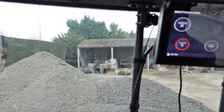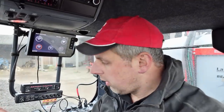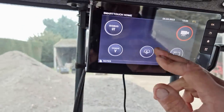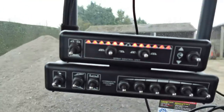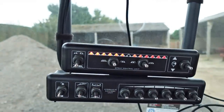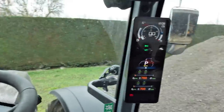You've got the option - they're both ISOBUS, they're both GPS. So you can run one screen as the ISOBUS to control the machine and the other one as your GPS, or as a camera. So that's the sprayer screen on the ISOBUS where you can adjust all your stuff. You can do it manually as well - you've got all your sections there so you just knock that over to turn your sections on and off. Of course it's full section control on RTK so it's a really accurate system. There's all your folding controls for the booms.